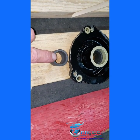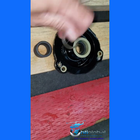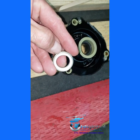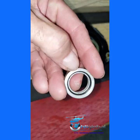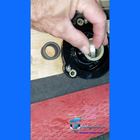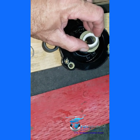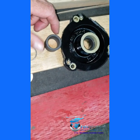To remove this bearing, you're going to take out the retainer, the excluder, and the housing from this side — as I explained earlier. Note how the housing here has a shoulder on one side; that side can be called the face, and the back has the big shoulder. The shoulder always goes out. If you install it backwards, the excluder will pop out and you'll have an issue. The white Teflon's function is as a scraper — to make sure any dirt on the tube doesn't go inside the gearbox or wear out the bearing.